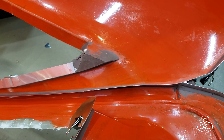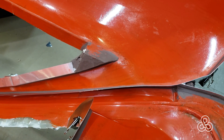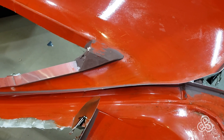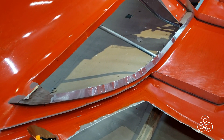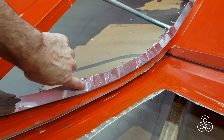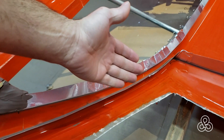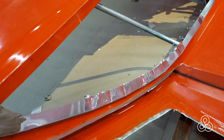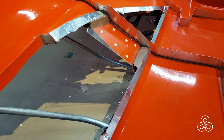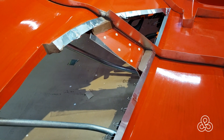On the side right at the corner of the front windows, this clay has been inserted so that it'll form a little triangle piece where the rearview mirrors will slot or plug into the door. Looking at everything upside down, we have this piece of flashing set in at five-eighths — that's where the track will be for the window that slides in and has a seal in it. As we get to this back piece, we have the lower and top piece around the plexiglass at just three-eighths, because that's just the channel for a fixed piece of window.